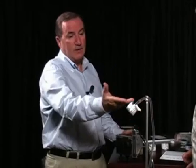So what about elevation and comparison samples? The elevation of the room in which the indoor sample is being taken, and the sampler on the outside. Do you try to eyeball it, see where the elevation is, or does it matter? It doesn't matter within reason. The idea is that you want to take samples at breathing zone. So it doesn't make any sense to take a sample in the house where you're standing at this level and then go on the roof and take a sample, because that's not the air that you're breathing. It may mix with the air that you're going to breathe, but it's not the air that you're breathing. Likewise, if you take a sample on the 10th floor in the building, you want to take a 10th floor outdoor sample, because that's the air that they're going to be compared with. Now, there is some debate about that, but that's normally what you want to do. You want to compare apples to apples. So you don't want to take one at the ground floor outside and then on the 3rd story or the 5th story inside. Those are two completely different kinds of samples. Okay. Very important.